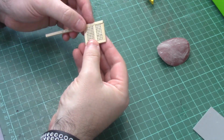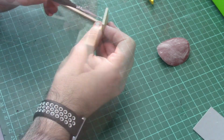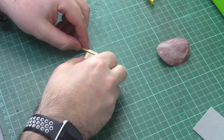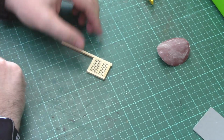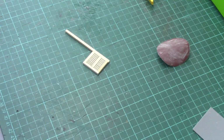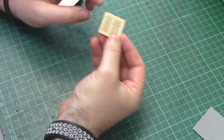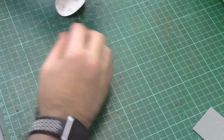So all I need to do now is just glue on this last 3x2, trim it exactly the same as I've done, and that's its grating done. So just put it on as flush as I can, just obviously so I don't have too much waste. Like I say, I'll let that dry 10 minutes and then we'll cut it flush. Okay, so all I've done now is trim off that last piece, exactly the same as we did all the other sides. So pretty much all we'll have to do now is go around with some sandpaper, get a nice smooth over, and then run over it with a nice tack cloth.